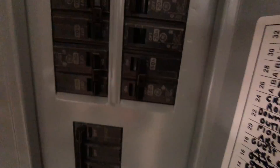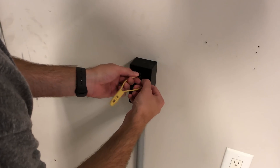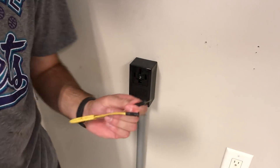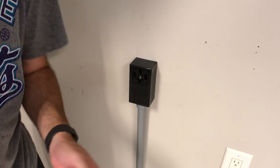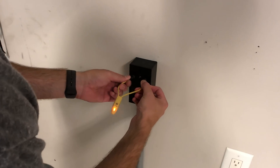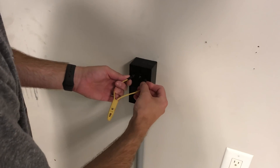I'm talking about electrocuting yourself because 220 power can kill you — or at least make you have a bad day. So we're going to turn the power off. Right in here, the bottom of the panel is that 50 amp breaker. Test to make sure there's no electricity there. A good way to test this: I'm going to turn the breaker back on and see that there's power going to it. The charger was plugged in, the green light was on. I just turned the breaker on and you see the red light popped on — so now we know that is the actual breaker. It's always better to double check than to ruin your day. I just turned that off and we're testing again — no light comes on. We're ready to take this apart.